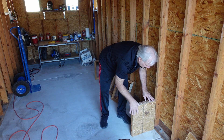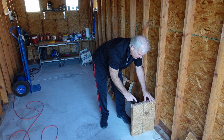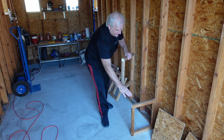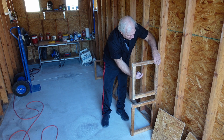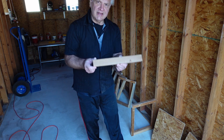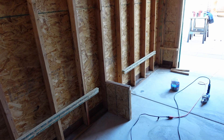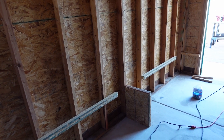What I'm going to do to firm this up is, once I have it attached to this 2x4, I'm going to take a bit of OSB and cover that up on both sides — that'll make this main support way stronger. The next one will sit up here, screwed into the 2x4 below and above. On the far wall I don't have a support like that; I'm just going to have individual pieces of wood screwed directly to the wall. I also put a little brace along the back wall so the 2x4 closest to the wall will be tied down in that direction as well.